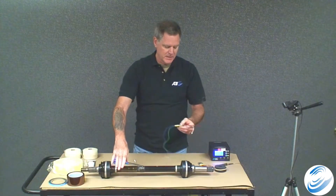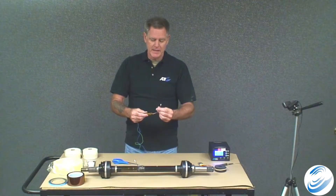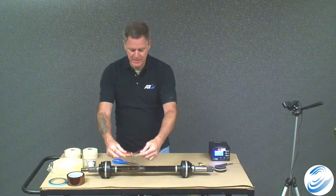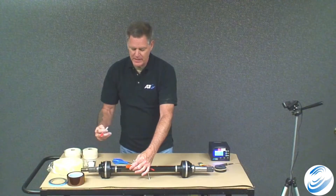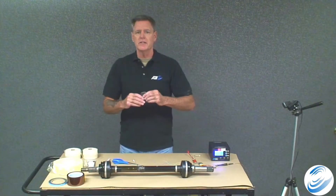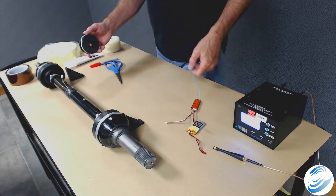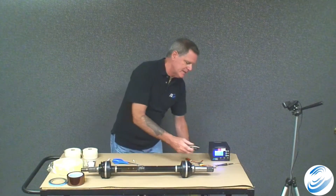Now we take our transmitter. The transmitter has a steel plate already taped to it to help protect it. It has a connector to go to the strain gauges and a connector to go to the rechargeable battery. Decide where it will be placed, then mark the back end. Take the one-inch insulating rubber that comes with the 2140 LP transmitter — we want to overlap this twice to insulate the antenna wires from the shaft. Cut a piece to length.